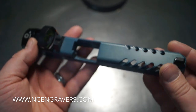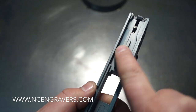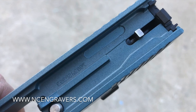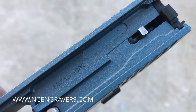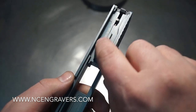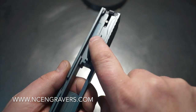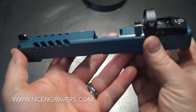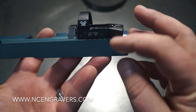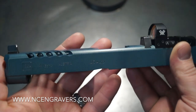Really pleased with the way this side came out. Let's talk about the inside before we skip it. We ended up plugging that right down through there — you can see a little bit of blue coloring and a little recess there. We put the plug in, it gets compression fitted inside, and we epoxy it at the same time to make sure there are no voids and everything's solid. Usually the epoxy goops out a bunch, so we scrape that off, and we get a little recess to make sure nothing drags on that pin and so we can see if anything moved during drilling and threading. With the optic mounted, the screw pulls the block up toward itself — the only hole into that block is the screw hole. It's always forcing itself up, getting tighter because it's a wedged block.